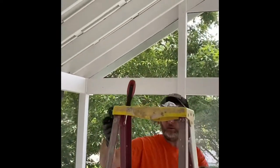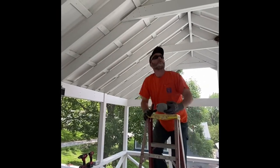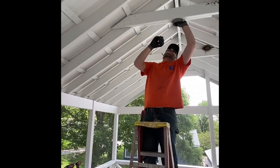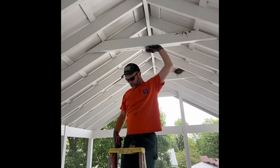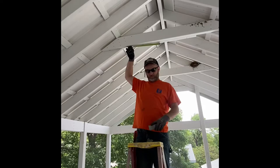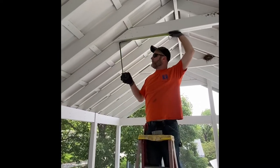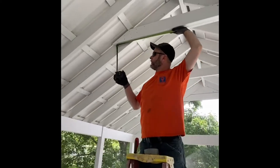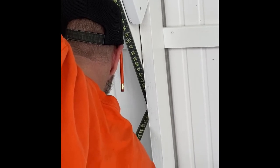We're going to mark our bender a little bit before the teardrop, and that should be about the center of our 30 — that's what we want. We're going to figure out where our box is going to sit, centered on the roof for aesthetic purposes. I kind of want to ride the center of this board, so it's going to be at about 27 inches — I don't want to go all the way to the back or I'd be on top of the board. So we're going to do 27 inches.